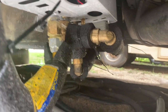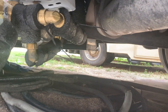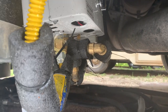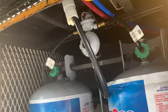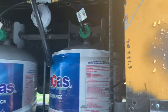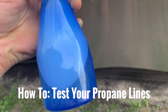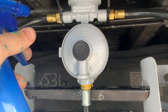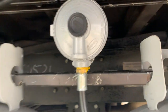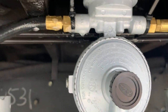I ran everything back behind and around to the bottom of the hot water heater, using pipe insulating foam to hug the lines and keep them protected. If we end up having any leaks, I might have to take a few off. This is our last connection for the propane — pretty simple, just used that goopy sealant. This is my soapy solution — half soap, half water. All you do is spray it, with the gas on, and wait to see if there's any bubbling.